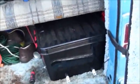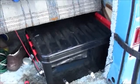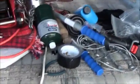I put extra weather stripping along the box to seal it airtight, and all the wires coming out — for the ground, the solar input, and the inverter outputs — were all caulked tightly so they'll be airtight. If you're thinking about doing batteries inside a vehicle, a lot of people just do it without worrying too much. But the potential for hydrogen explosions and asphyxiation is real, and it almost always only happens when the batteries are charging. Since this system will always be charging during the day, I thought it was worth the extra cost of copper to do it the right way.